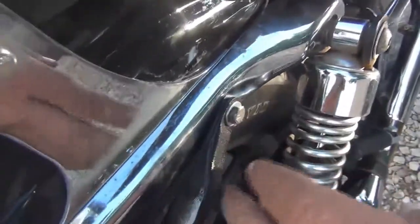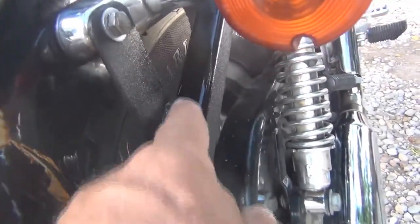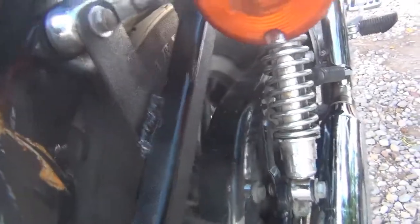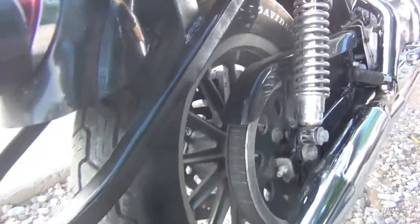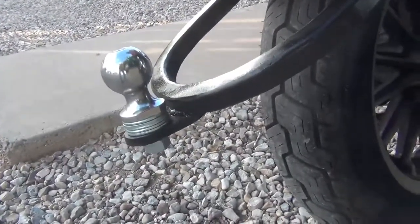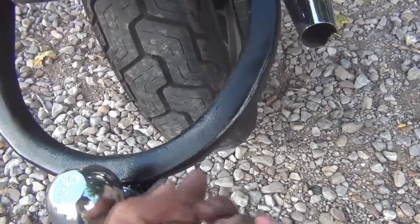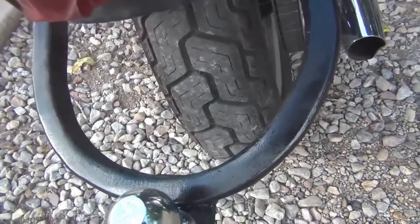You see, that's one of those sweeping pieces that I made. We came back here and just put a thin strap down there, welded up all four sides. Came around. There's the trailer hitch. One thing I forgot that's easy to fix, that's the safety chain. I'll just drill like a 3/8 hole through here and put a long bolt up there and bolt it in and put a couple of washers on there and put a safety chain rod on there like that.